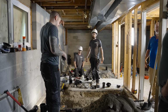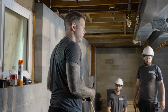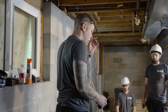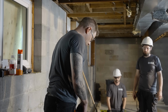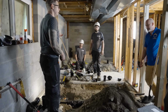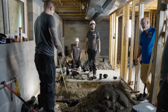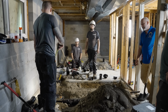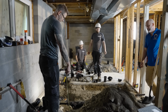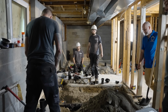Solutions. That's why you start fresh and you go with the flow of things. Yeah, you got to. I said earlier, it doesn't matter how you do it, as long as you do it right. We had a mentality of how we want to do it. There's a giant boulder causing us problems. It just took a mind to remember that we have a dog wash station here. So we're going to wet vent the floor drain through the dog wash station. All legal, yes. It's saving us having to pull up this boulder. Get rid of that P-trap. So we're done, no more digging. Nice.